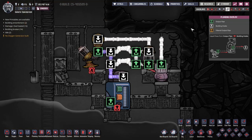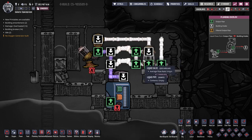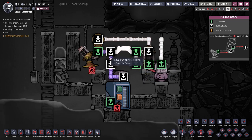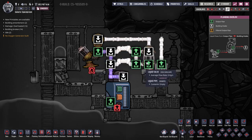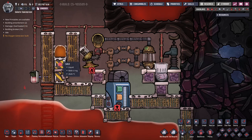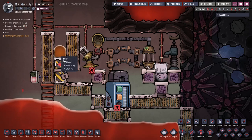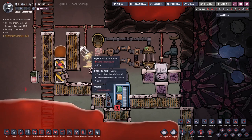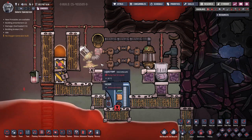Let's look at the plumbing in more detail. We have the output of the pump going through this passive filter. This passive filter is presented by Tony Advanced in another video — I'll link below. In this particular case it's being used to filter two liquids and then recirculate the priming liquid. The priming liquid is not hot, whereas the liquid we want to pump — in this case gold — is hot. So this pump cannot touch gold; if it does it's going to break. But it has to detect a liquid in order to operate at all, so we need a priming liquid.